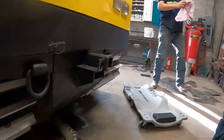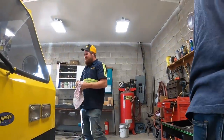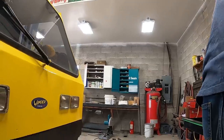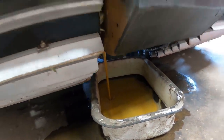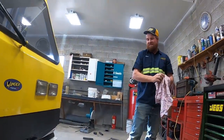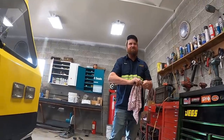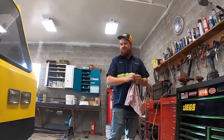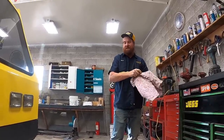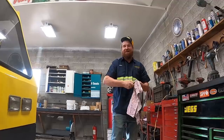These are pretty simple, rugged machines. Okay, pop these. That's not the color of gear oil. This actually doesn't even take gear oil. It takes, I think, a mineral-based Ford tractor hydro lube. I mean, it is a gear oil, but if you put regular gear oil in here, it ruins the bands, but I can't imagine water does the bands a lot of good.